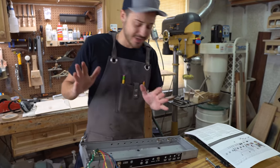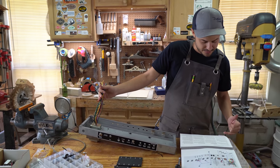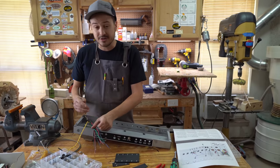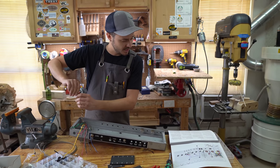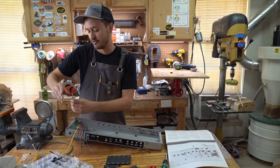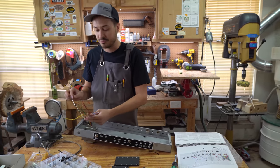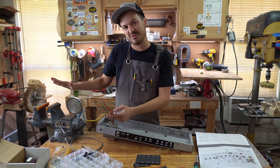We've got the main power transformer in here. I've gone through and twisted the appropriate wires — we're here in the United States so I'm wiring this for 120 volt, which uses the aforementioned black and white wire. Eventually we're going to have to terminate some of these other leads, but we'll do that in a later step — that's future Matt's problem.